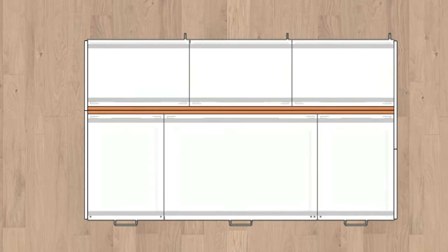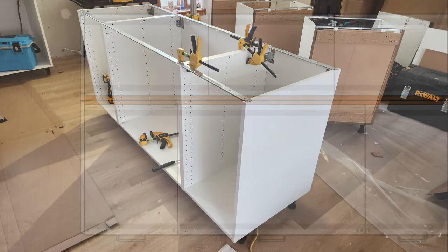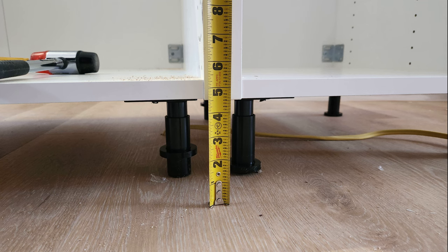You can see that clearly in this picture from the IKEA planner where I have pushed those cabinets a bit away from each other, so the panels on the side can sit back-to-back without the need for cutting. After you have assembled all the cabinets for your island, take the full depth row with the assembly kit strip protruding as we just talked about, put it where you want it, and make sure you have four and a half inches from the bottom of the cabinet down to the floor as a minimum before we proceed.